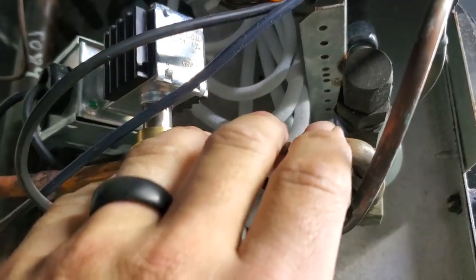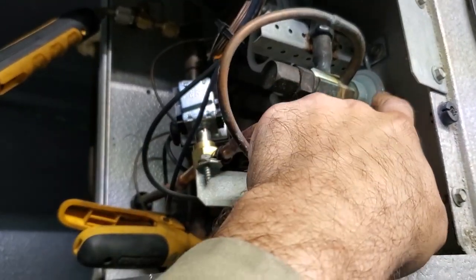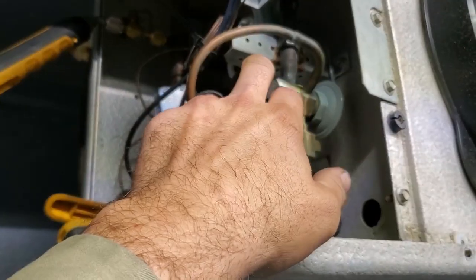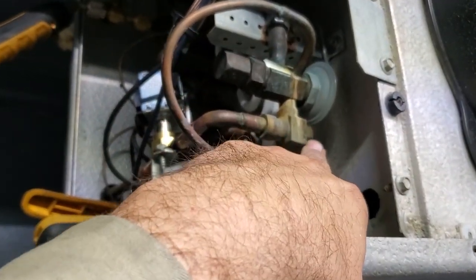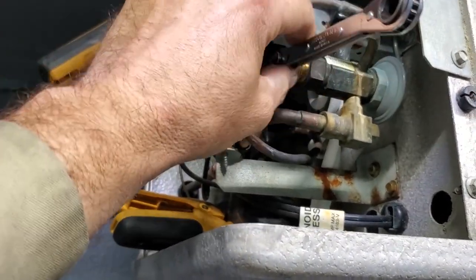This is my valve, and my distribution tubes are frosting up. I did confirm though, that is a pressure limiting expansion valve. So that could be part of the problem. I am gonna go ahead and try to adjust on it, and I'm gonna pull that strainer and check it also. Yeah, something's up with this valve. Someone's been wrenching on it.